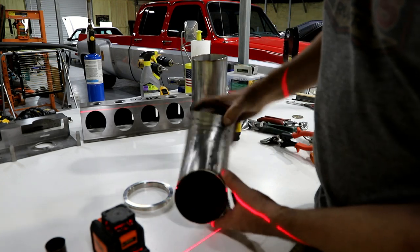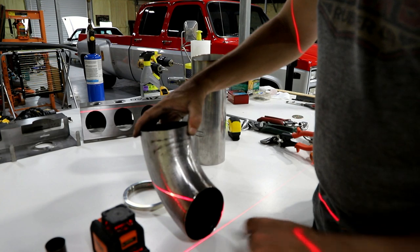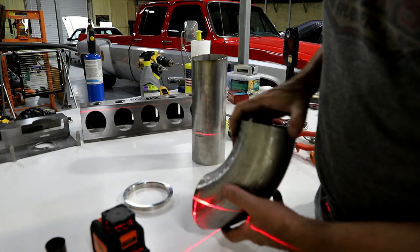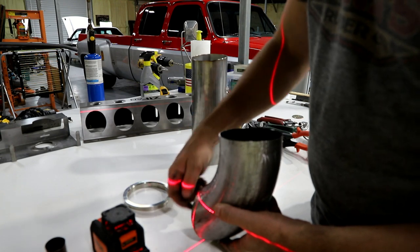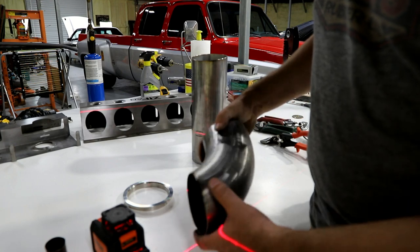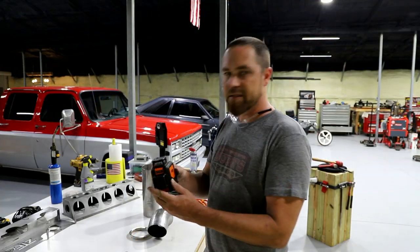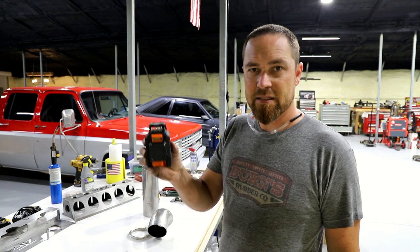So what I did is you can take it and line it up on the line on the bottom, then just roll the top in until it matches up with that inch, and then you can kind of mark that thing around. Flip it over, do the same thing on the other side, kind of mark it around. Then cut it and clean it up, and you're usually pretty close to a flat cut right off the get. So yeah, I guess it's more of a technique than a tip.